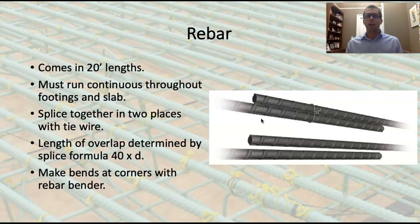That being said, rebar is kind of rough work. We're not pulling out our tape measures and making it exactly 20 inches — it can be longer. We're not going to cut a little bit off the end of a stick to ensure exactly 20 inches; we're just going to overlap it more. When I'm running number four bar in the slab or footing, I tend to overlap everything 24 inches because 24 inches is two feet, and that's very easy math. Whatever I need to splice, I just add two feet to that number.